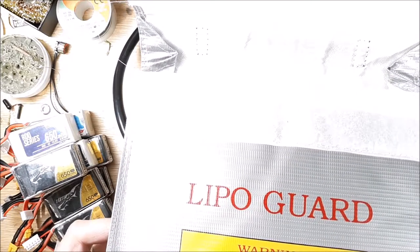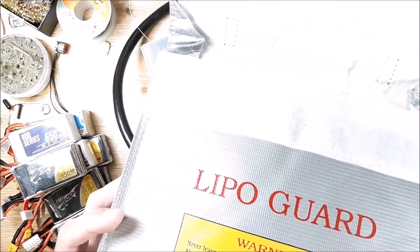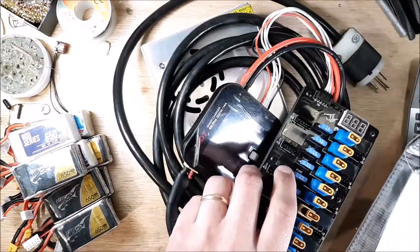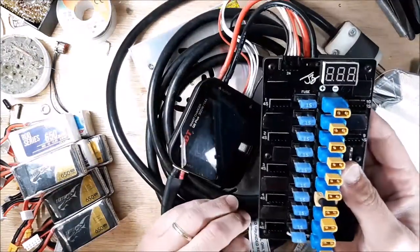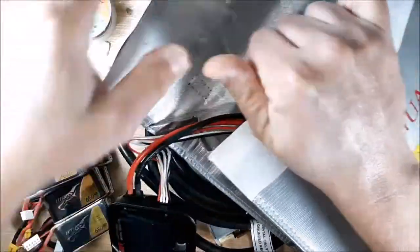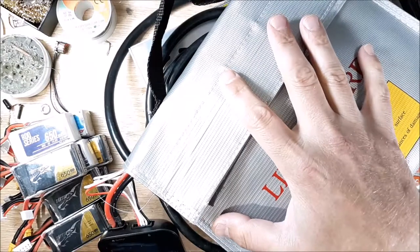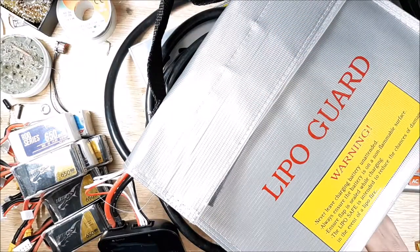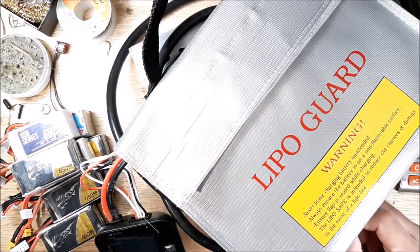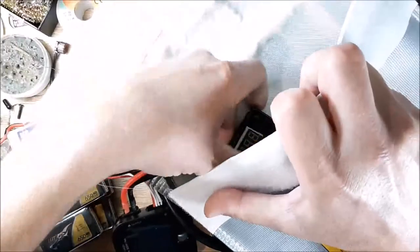I never leave the room when I'm charging — I'll sit down and do a project with the kids or something. When I charge, everything goes into a lipo guard bag. I hook up all the batteries to the parallel charger, slide it into the bag, and close it. All the batteries are contained inside with the parallel board, so if there's an issue I can just grab it, unplug it, grab the handle and fling it out in the yard.